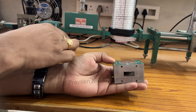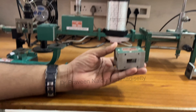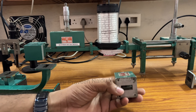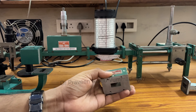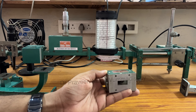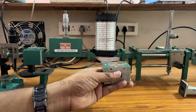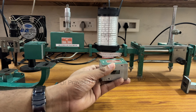The next component is a circulator. We can see here these are rectangular waveguides — port number 1, port number 2, and port number 3. It is a three-port circulator. This circulator we are also going to use in our microwave bench and we are going to perform the properties of the circulator in this lab's playlist videos.